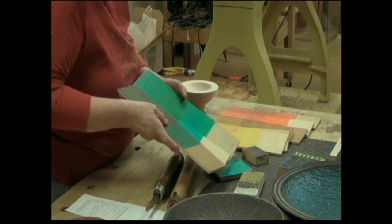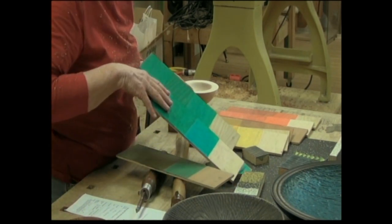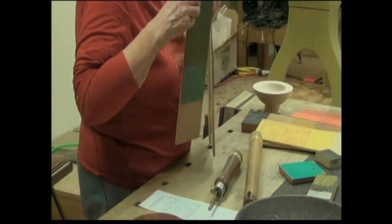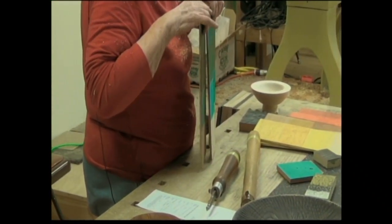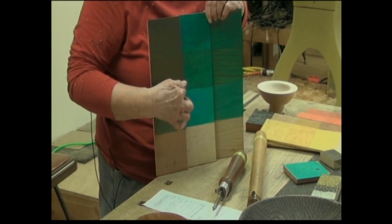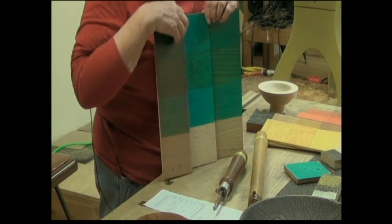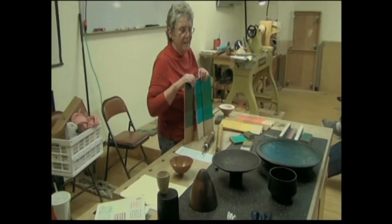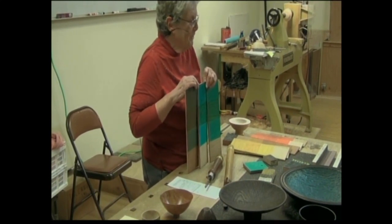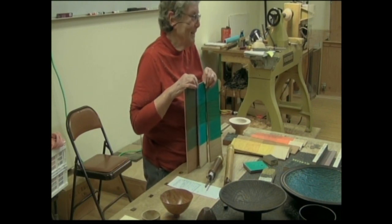These are 3 different woods: a mahogany, a bird's eye maple here, and oak. And it's the exact same dye. I think this is important, not so much to learn, but to just have in your mind if you're adding color to a piece, because that's the same dye on 3 different woods, because the wood is colored. I started with fabric dyes, from a dye shop that had fabric dye. And I said, I need white. These colors are really muddy. And they looked at me like I was crazy because there's no white dye.